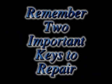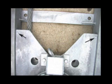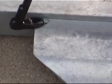The SCI-100GM can be reset very quickly by industry standards by knowing a couple of important facts. First, we have two shear bolts in the mobile sheave assembly at the front of the cylinder. After these bolts get sheared off, the remnants must be removed before you try to pull the cylinder and sheaves out. A ripping bar works well for this procedure.